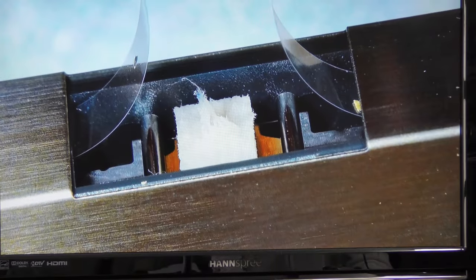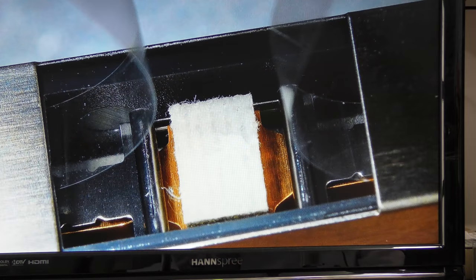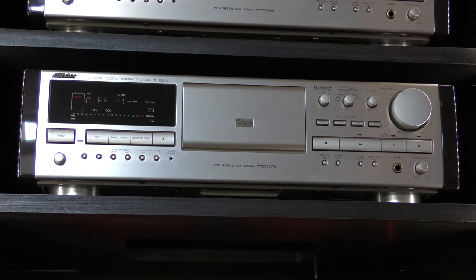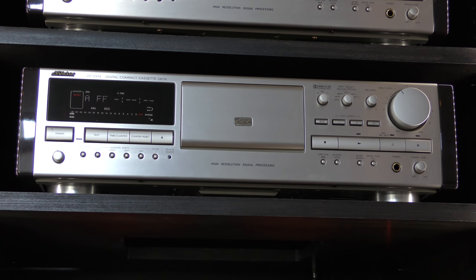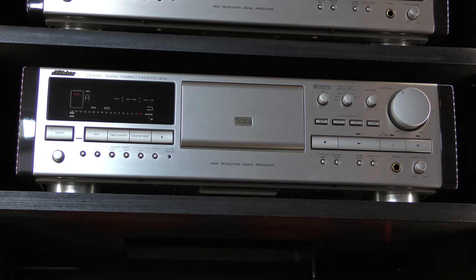Some of the finer top part might stand up and has to be removed. This is how it should look after removal of the debris and while drying. After looping the tape back into the cassette using the traditional pencil, we wind the entire tape forward and then backwards before playing it — that way the felt pad is nice and smooth again.